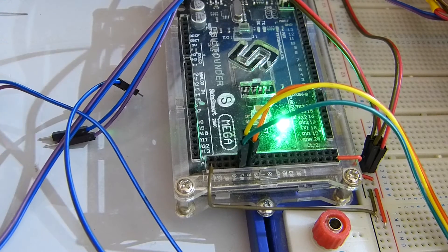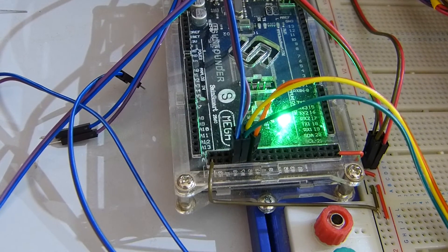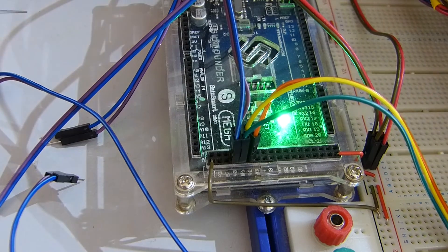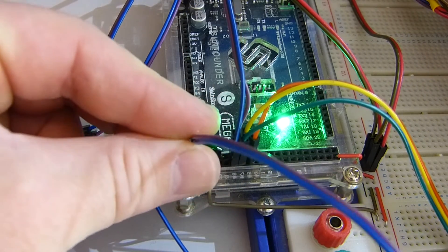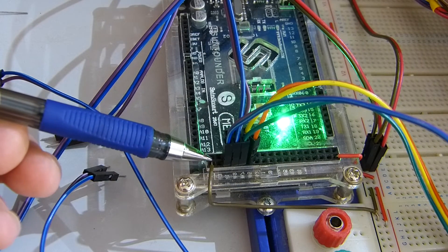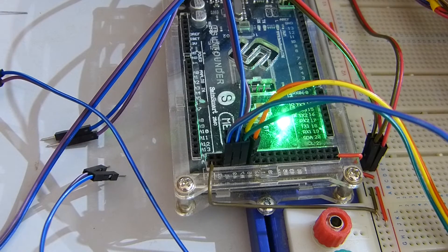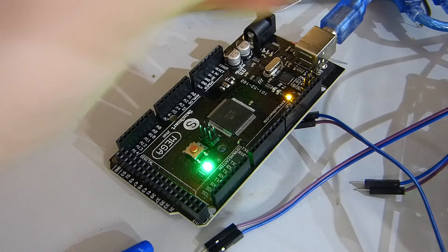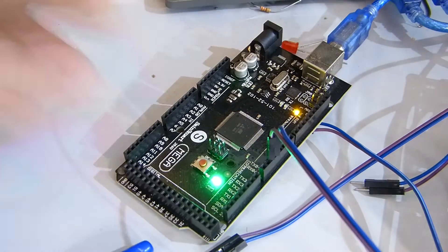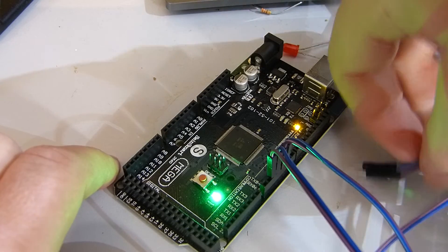That just leaves the green, yellow, and orange to connect to the Arduino for the data lines. The encoders have got five pins. At the top we have ground, positive, and the middle one is SW — the switch — so if you push the encoder in it makes a contact. We're not going to use that on our MCP, but we are going to use the clock and the data lines at the bottom — so the top two pins and the bottom two pins. First up into the Arduino board is the altitude encoder at pins 48 and 49. Next up is the captain's course — that goes into pins 50 and 51. I do have two pins left over, pins 52 and 53, but these no longer work on this board, so I have to sacrifice these and move on to the next board.